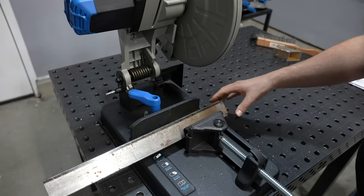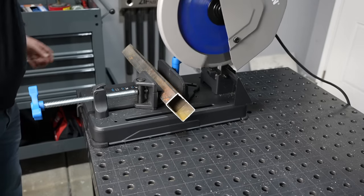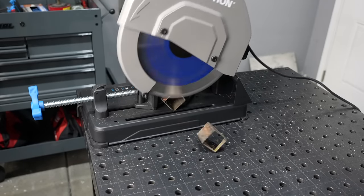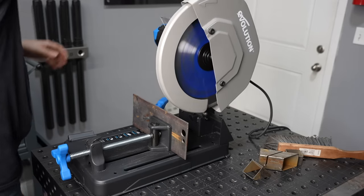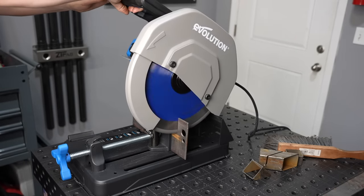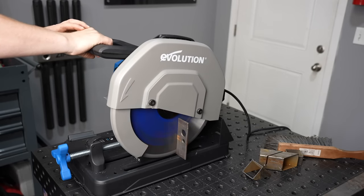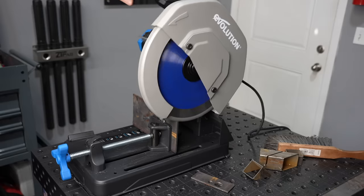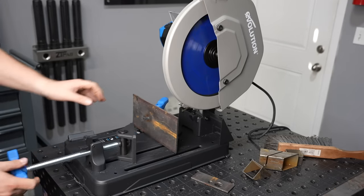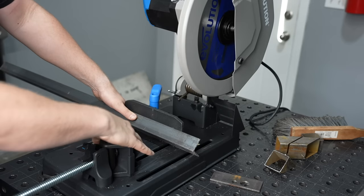This block will only fit two-inch and larger square tubing in my experience, so if I'm working with one-inch square tubing I just have it sit flat. For miter cuts you usually have to have it sit flat too. But it cuts through really well when sitting vertically. You'd also want it to sit vertically when cutting flat bar — rather than running flat on the face — and you can see how it just cruises right through. If you're having a lot of blade wear, look at the orientation of the part and make sure you're cutting vertically. You can get thousands of cuts out of a single blade.